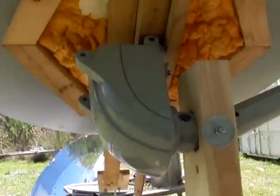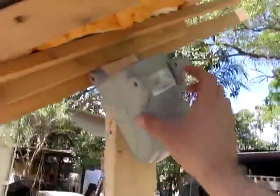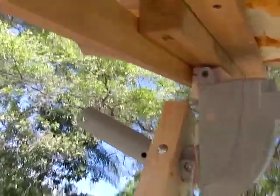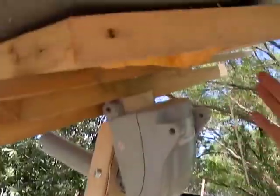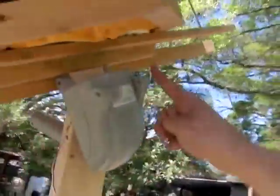This is a standard satellite motor. These are about 60 bucks. A little bit of a hack you have to do to these, because they're designed to be controlled from a cable box or a satellite box. You void the warranty, of course, but you basically just take the control board off and hook it direct to the motor. That way you have your power source.